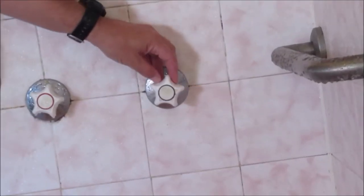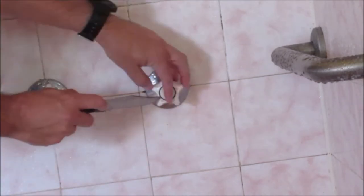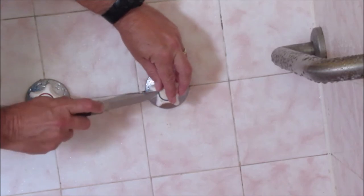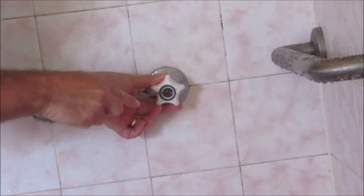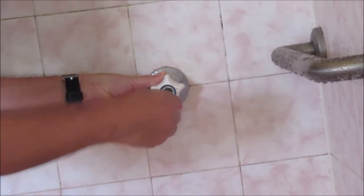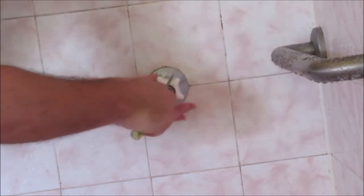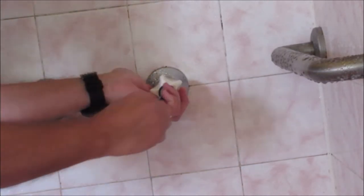There are all sorts of different taps but these ones just have this outer cap, so you can just pluck that off. Put that out of the way and then there's a nut on this outer ring - it just has two grooves and if you just use a screwdriver you can normally get it to undo quite easily. I'd also suggest putting something in the drain so that you don't lose anything.